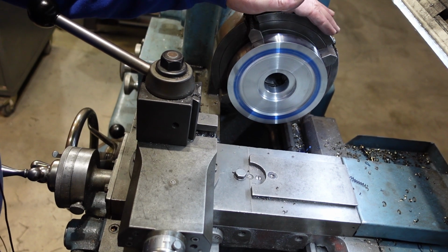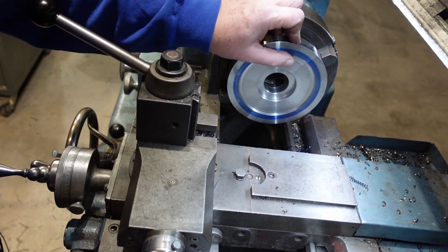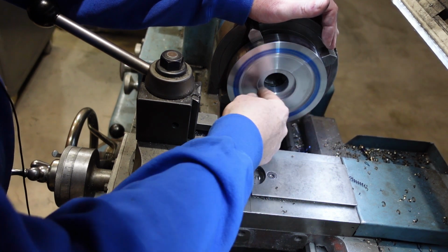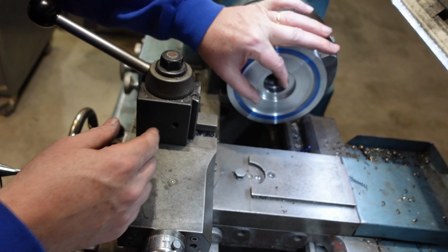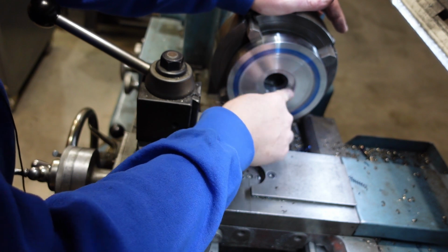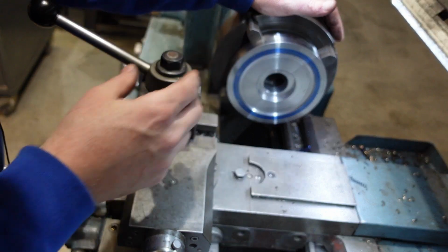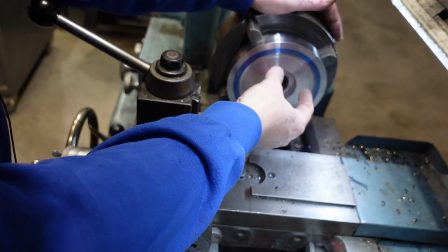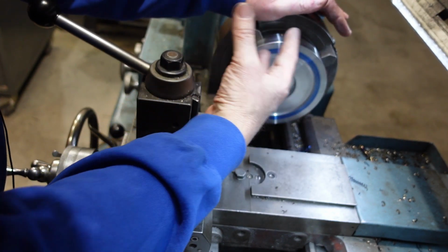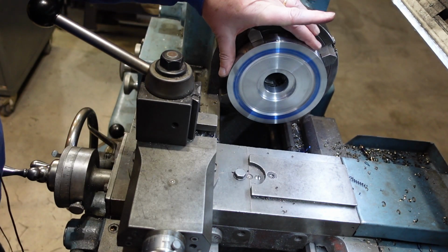Here's the disc, a whole lot of turning later. The original has a step in, so it's only running on the outside of the disc, so I've put that in there. I've also put a bore in here for a piece of round to go in and a bit of a step. So the idea is I'm going to turn the opposite feature on a bit of bar stock, push that in there, then I've got a bit of bevel here I can run around with some weld. I can do the same there, and fingers crossed I'll have a nice rigid structure. I'm not going to turn this down until I get that welded in there, in case it moves when I weld, and then I'll clock it up again like this, pop a centre in and do all the turning down and threading and that sort of thing I need to do here.